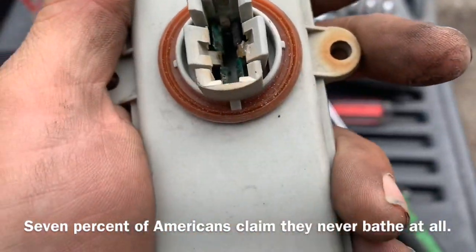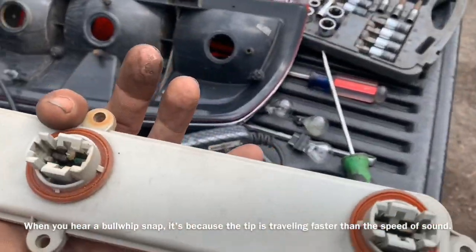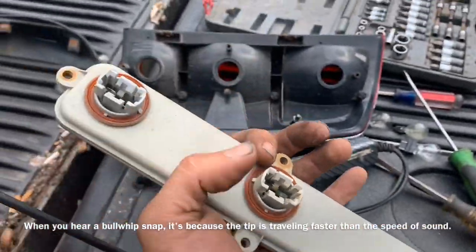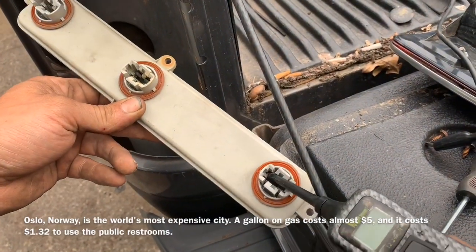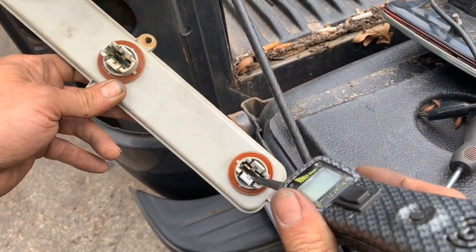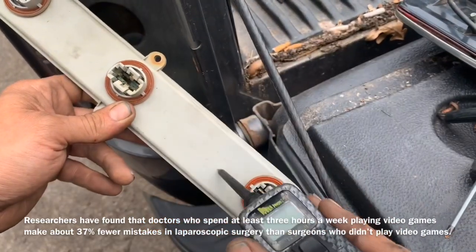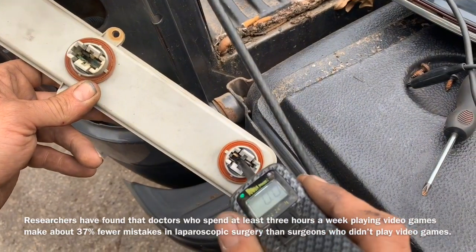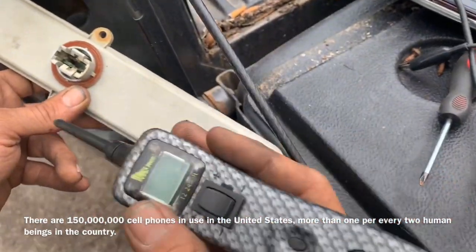We also need to look down inside the board and make sure there's no corrosion - this one's corroded right here, but that's not the circuit that's not working. It's actually this one here. We need to plug it back in and double-check for communication, see if we have ground where we're supposed to have ground. We should have one chirping one and one that's not - the elongated part is our blinker up top. We should have that chirping noise right here. We don't - so we know down inside this board there's something broken.